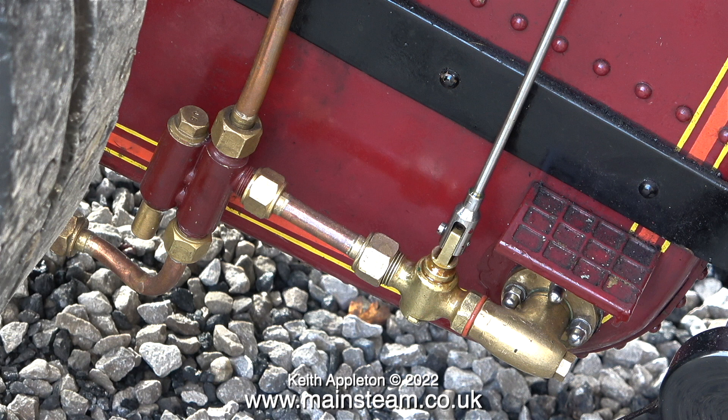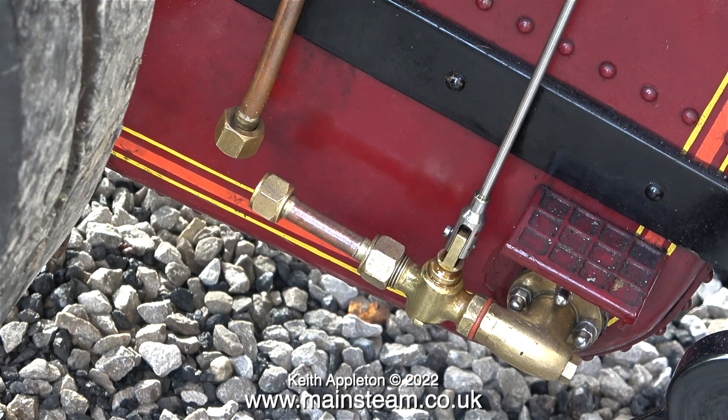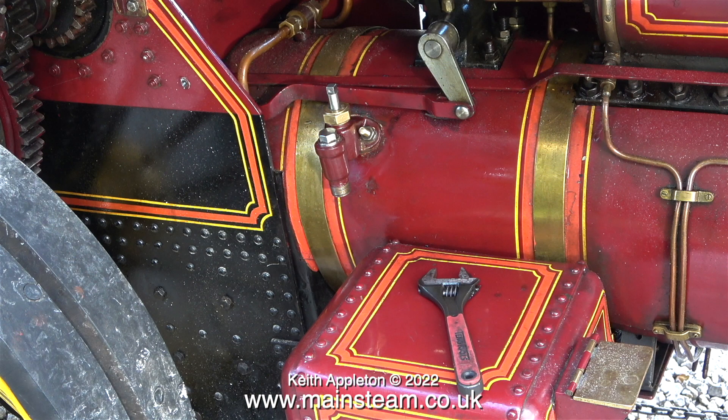I've redone the water inlet supply. The top pipe in this photograph is the steam pipe, and when I open the steam valve in the bunker a high volume, large amount of steam comes out of this pipe. My diagnosis on this problem — helped by conversations with various friends and people in the business — led me to conclude that the injector's capacity was too high for the boiler, and also that the check valve is in the steam space, not in the water space.